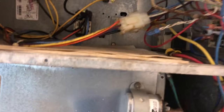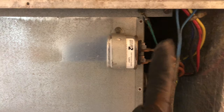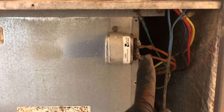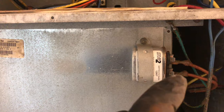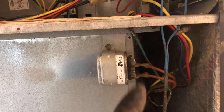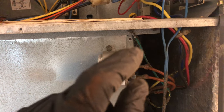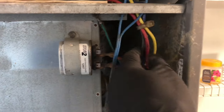We're going to remove all the wires, but first I need to discharge this thing. When you want to discharge it, you need to make sure there's no more power stored in the capacitor. The capacitor always stores a high volume of electricity, so you always need to short-circuit that thing. I already did that, so now we're going to remove everything.